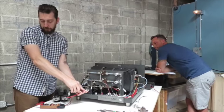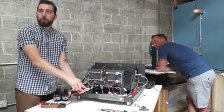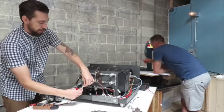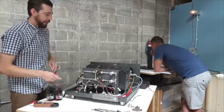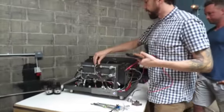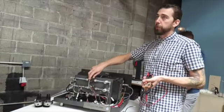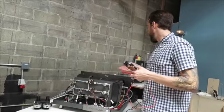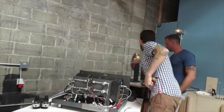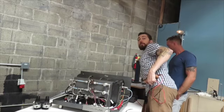So you can go right there. Okay, I'm getting 23.7 volts. It's pretty appropriate, so that's working. You can go ahead and turn that off. Actually, we can leave it on for a second and we can check some other stuff. So this, I think it's 5 volt power. I think it uses 3 volts actually is the signal it sends. All the thermistors use 3 volts. And then the actuators that open this up here, those use 24 volts.